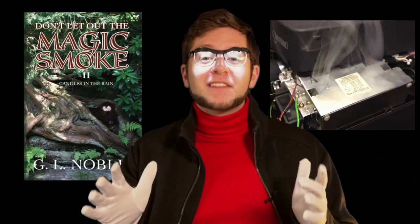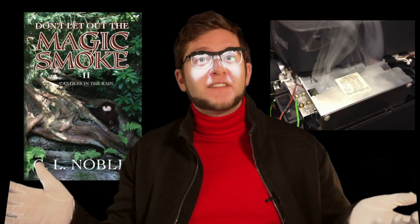Let's talk for a sec about what soldering is. It's using a metal with a low melting point to glue together two metals with higher melting points, in order to allow electricity to flow between them. It's different from welding, which melts and mixes metals together. We solder rather than weld our circuits because electrical components are delicate — we'd let the smoke out of them if we cooked them at 15,000 degrees. I'm soldering at a slightly lower 400 degrees.